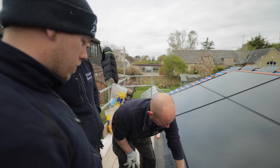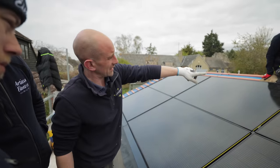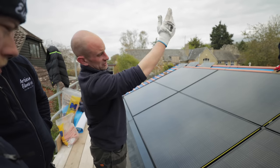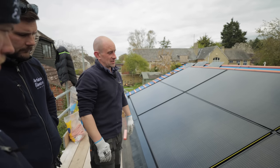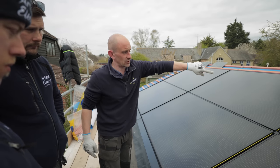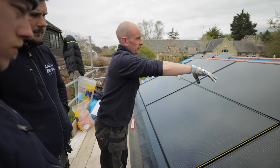Once you've got your height set with the bottom gutter, you know the laps are going to be correct. Go to the end of the yellow gasket, put all the gutters in dry and put all the cover flashings on all the way up. It makes life easier because when you're turning that panel in, you've only got to reach across the panel to put that last cover flashing on.